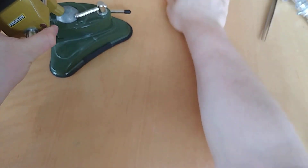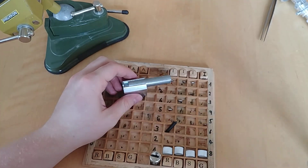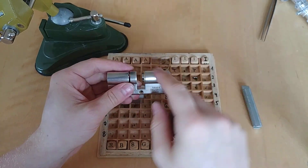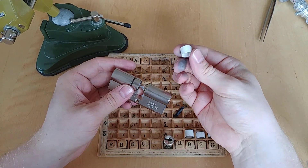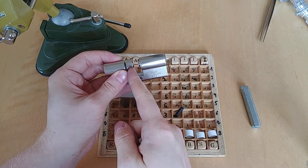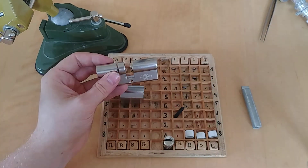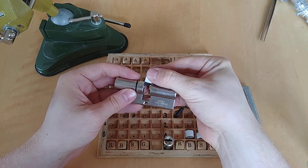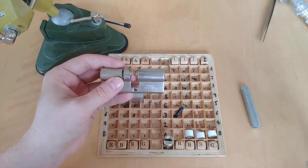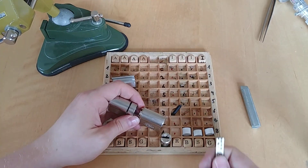Hopefully without any problems. I'll show you what I watch out for not to get any problems. First, I've already gutted the other side of the lock. It took longer because I had to pull out both sides of the core, just so much that this part here does not stick into this space. Then I took out the actuator with all moving parts inside, and then I could insert these thingies and push them through like a follower. But it takes much longer and it's a bit more complicated, so I don't want to risk too much in the gutting on camera here.